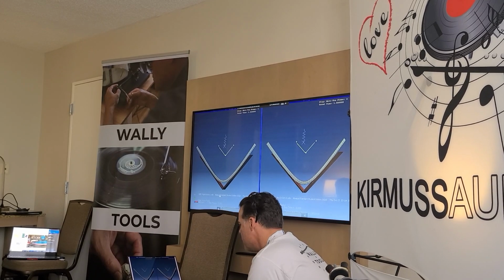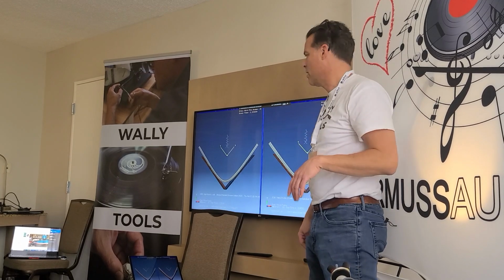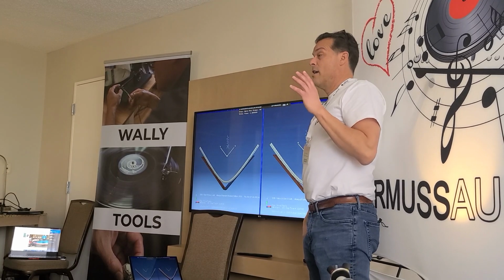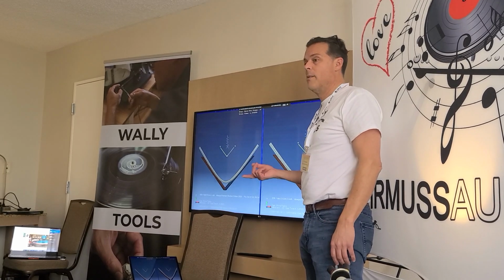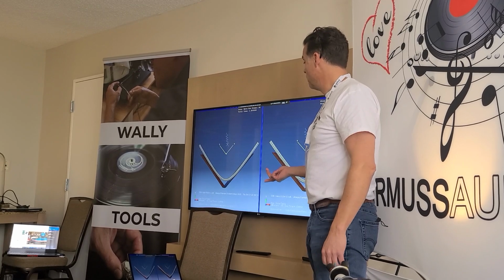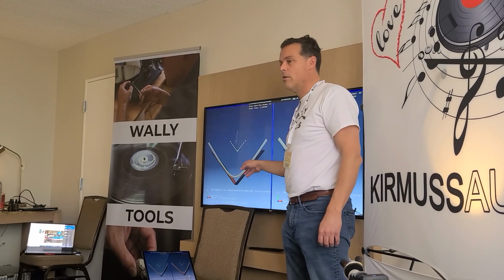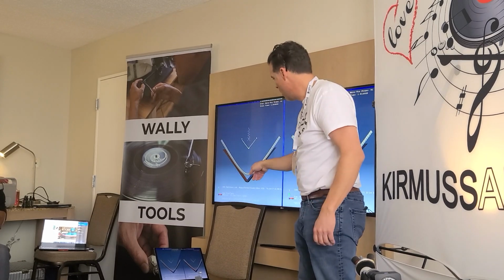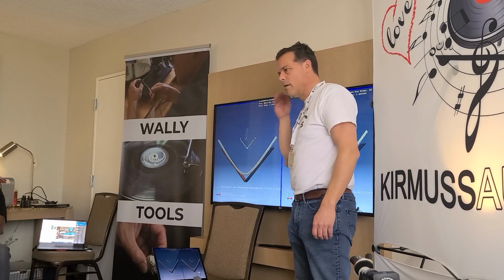One of the benefits of having a partner who is also head of R&D of Medtronic is that we get access to a lot of PhDs and a lot of equipment and a lot of software that's not otherwise available. So we had some work done in finite element analysis, which is very expensive software, about 25 grand a year, where we recreated a horizontally modulated groove. You're looking straight down the groove as if you're standing at the basin of the groove looking straight down. And then we built this fine line stylus. And we said, okay, travel down the groove.